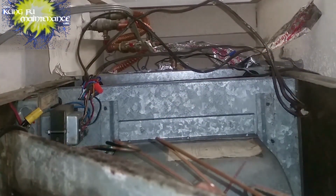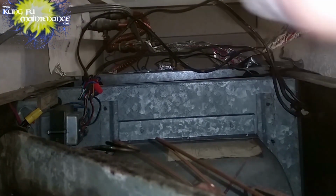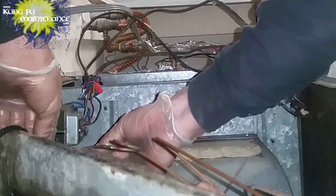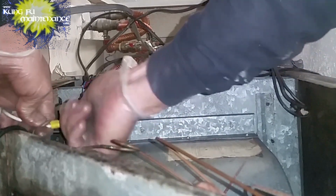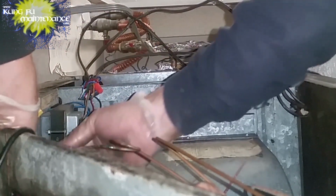The wire nut had a screw stuck in it. So on this one, just hooking up the white and the black wire. Different applications, again, will have different setups for different wire speeds. What you never want to do is hook up the black and another color together. That could burn out the motor.